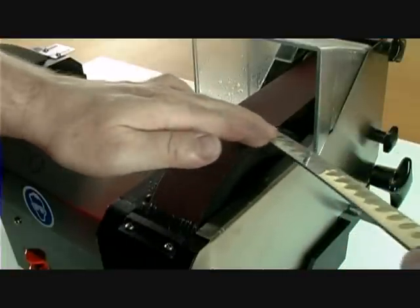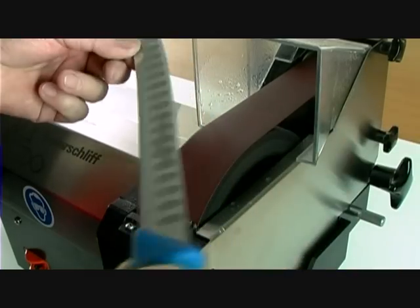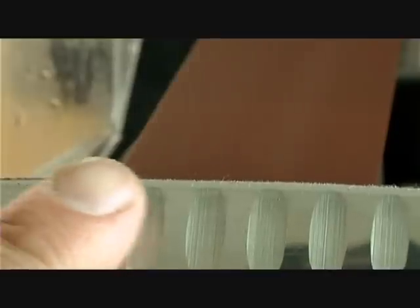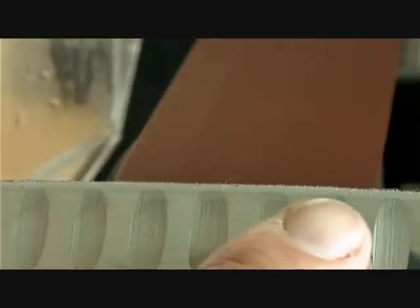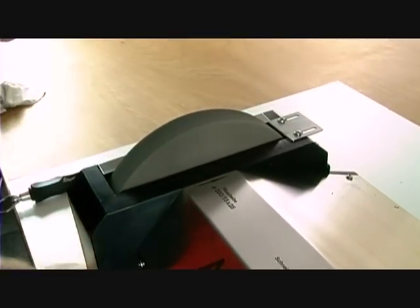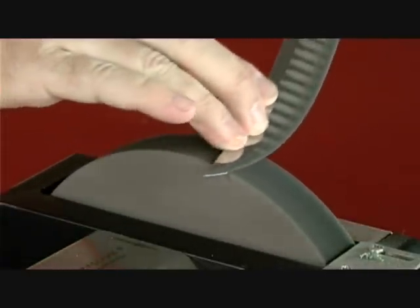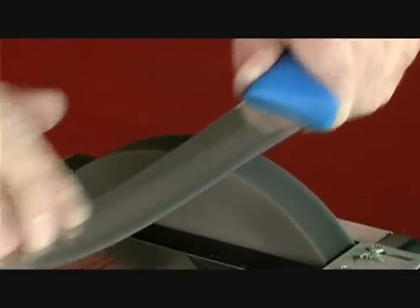The final sharpness of every good knife is achieved through 2 work processes. The initial rough grind produces a thicker burr or edge. In the second process, this edge is polished and thereby smoothed. An extremely fine microscopic burr consisting of many small teeth is produced.